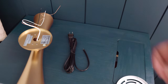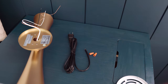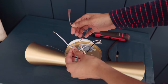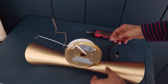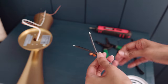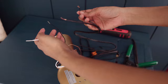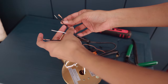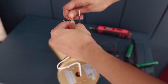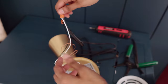For this you need a lamp cord and wire connectors. Every lamp has a hot or black wire, neutral or white wire, and a copper ground wire. The plug-in cord also has positive and neutral wires — the ribbed wire is the neutral and the other one is hot. You just have to connect both hot wires together and the neutral wires together. The ground will be connected to the metal casing of the lamp while mounting.